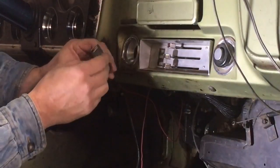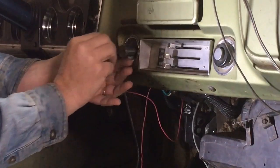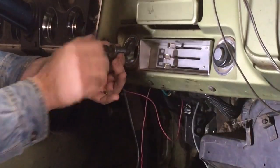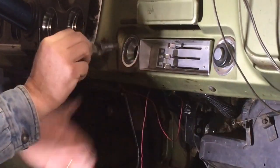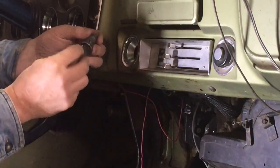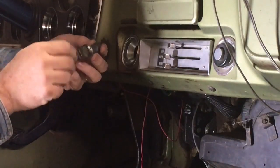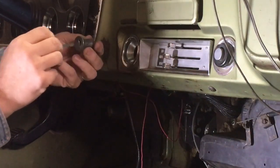Normally, when you unlock this, the key should not pull back out of the system. Once you get the cylinder out, don't turn the key again — right now it's prepared to go back in and work. This particular cylinder is damaged in that locking position, so the key should not be able to pull in and out.